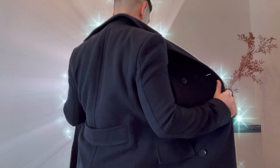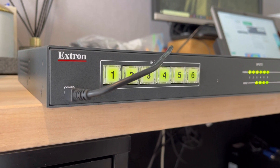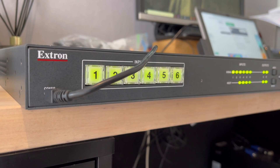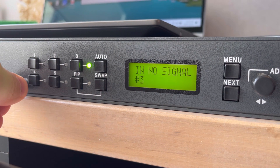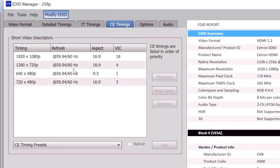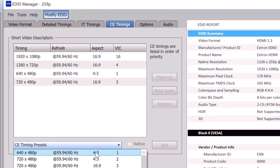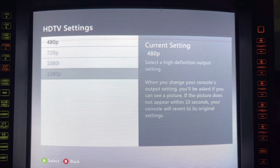The first step is to flash the DVS with a custom resolution. For those exclusive Extron insiders with the PCS program, simply plug in a mini-USB cable to a PC, import the pre-made 1920x240p EDID, and drop it to one of the custom resolution slots. If you also have the EDID manager, I suggest you first alter the CE timing presets to ensure that each resolution is selectable on the console.